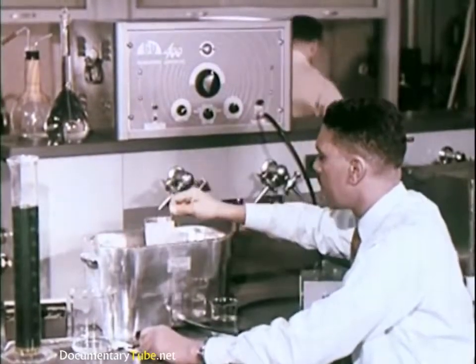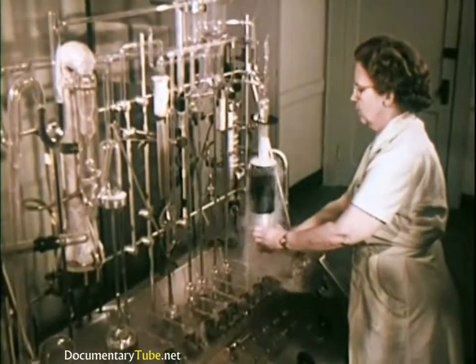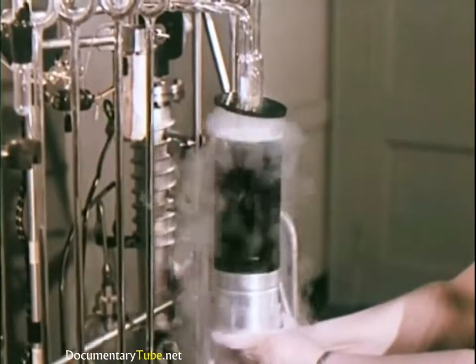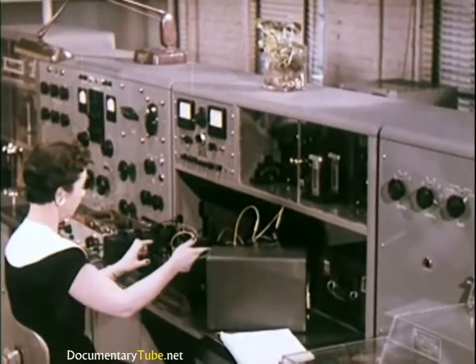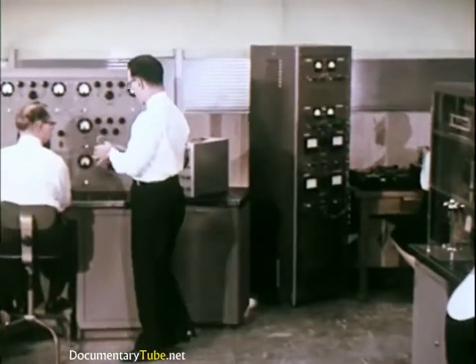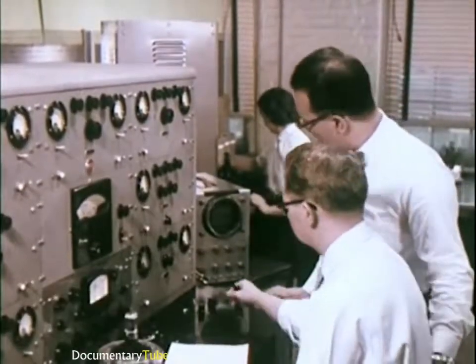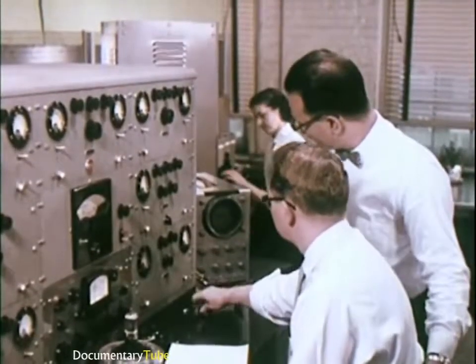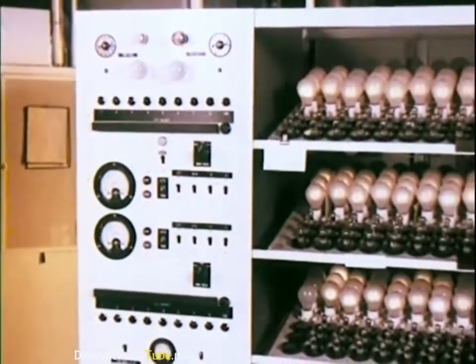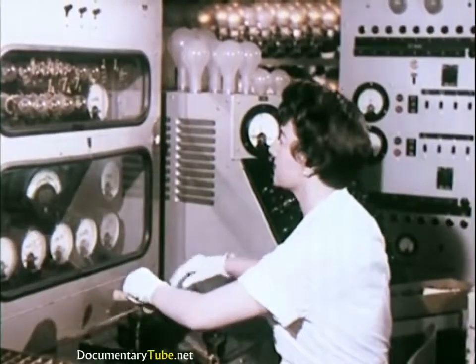In this work at Harrison, research engineers work with the unusual — machines that clean materials with ultrasonic sound waves, machines capable of testing the strength of wire finer than a human hair, even liquid nitrogen, as well as induction furnaces capable of heats of over 4,000 degrees Fahrenheit. To maintain accuracy, a special laboratory checks all test equipment using units certified by the National Bureau of Standards. Quality standards are also controlled by checking characteristics of tube samples against master specifications. After manufacturing, every tube is aged in racks at 3 to 4 times rated filament voltages and then 100% tested for operating characteristics.